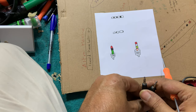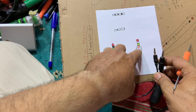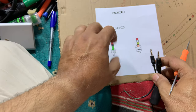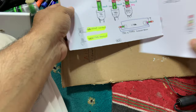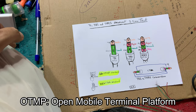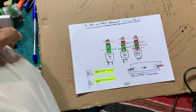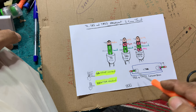We are going to use the standard, correct coloring and correct pinout for all of these. I made a drawing about this — I searched for it and found it. Here it is: those are the TRS and TRRS pinouts according to the two standards, the OMTP standard and the CTIA standard, and you can also see here how to connect TRS to TRRS.